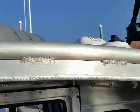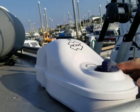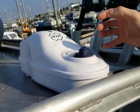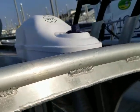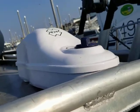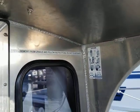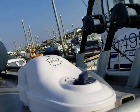This vessel is also equipped with an EPIRB — that's an emergency beacon. If triggered, it sends out a distress signal with your location to the Coast Guard. To access the actual unit, turn the blue dial counterclockwise, pull the lid off, pull the unit out of its cradle, and then press the transmit button. If you're in an actual life-threatening emergency, make sure that you use all the available assets you have: cell phones, the VHF distress button, the EPIRB, flare gun, and calls out on channel 16 on the VHF.